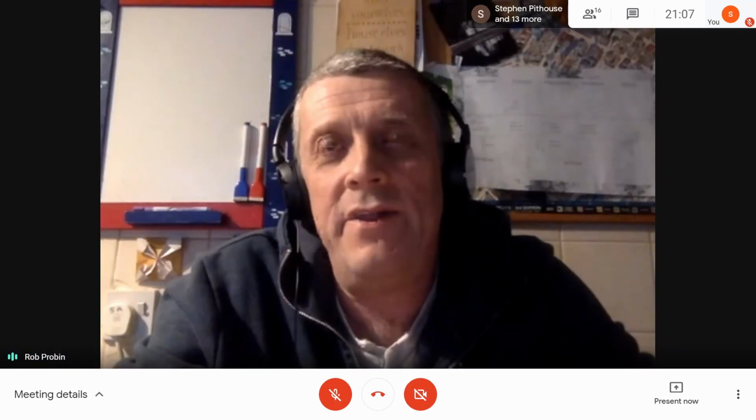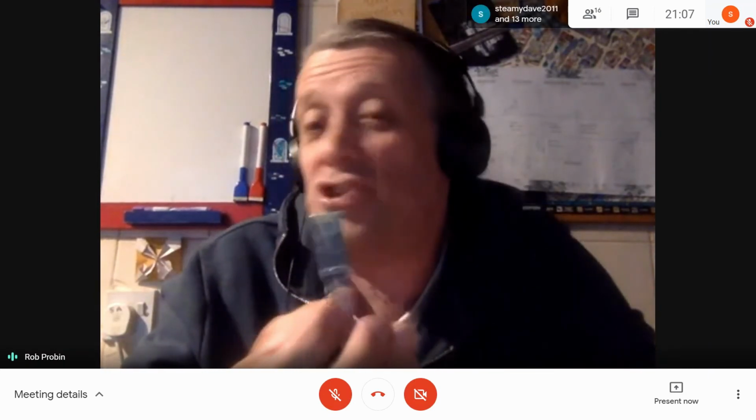So, do you think it's worth looking at, or do we just stick with what we know? Because I couldn't see anything that jumped out as wouldn't it be wonderful. No, I agree. I think the HC-05, if you can stand the weight, which is not very heavy, with PCs just works. There's really good support for it, and everybody knows how to use it. You just connect the serial pins up, and you're away, assuming you can configure the baud rate. It's variable, would be the answer to that question.